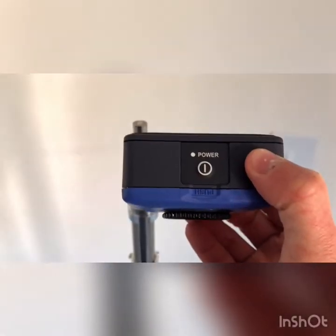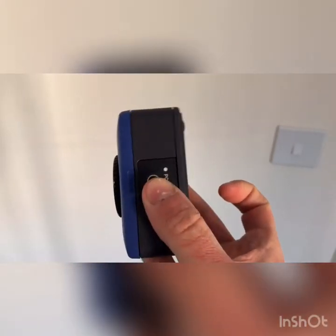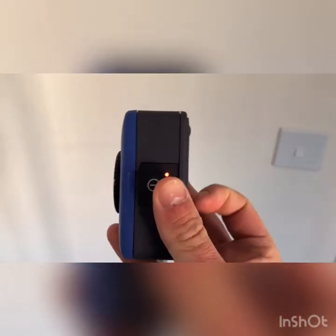With the microphone sitting on top of the pole and the plastic collar in place, it's a great time to calibrate the microphone using your NC-74 or NC-75. To turn the NC-75 on, press the power button and it will light up. On the meter, press the CAL button to go to the acoustic calibration option. When finished calibrating, make sure you apply the WS15 windshield correction.